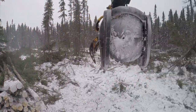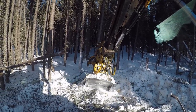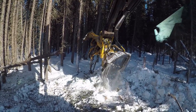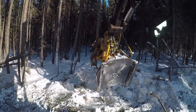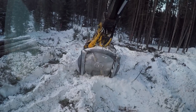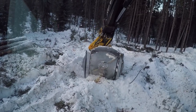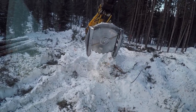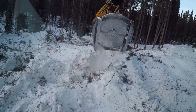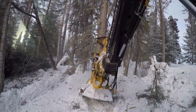If this happens, turn off the saw using a stump or similar means, then force the blade to rotate in the opposite direction until it moves freely again. Then turn it back on and wait for the blade to reach proper RPM before cutting again. In more severe cases, wedge pieces may need to be removed manually using bars, hammers, or other tools.